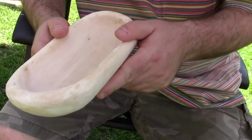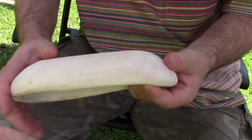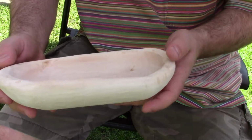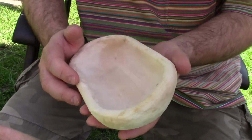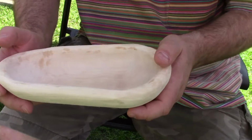And it's only taken about a week for this to dry out to probably a usable state. It's probably got some more moisture to shed still, but we can actually work on it with ordinary tools and methods now. So I've carved it with the axe and then sanded it with the rotary sanders, and all that's left to do now is a bit of hand sanding